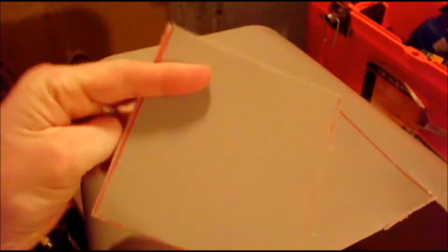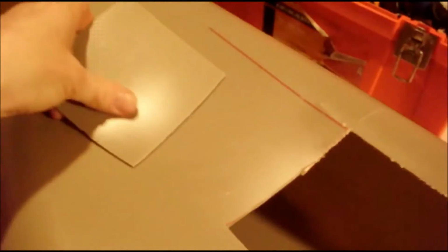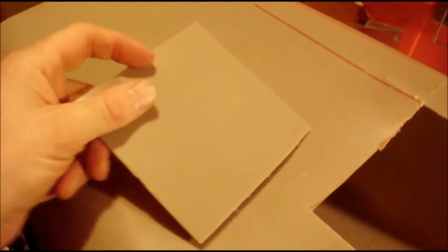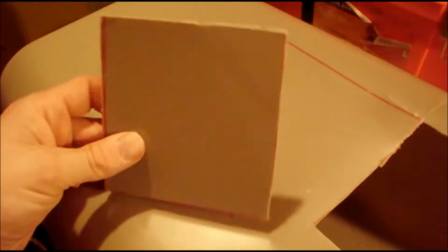All right, I bought one of these Rubbermaid trash cans at the Home Depot. And this is the plate that is going to go over there. You can see the lines. Thing is, I'm going to paint this, but I find that this material, and I've looked and looked and looked for craft materials and stuff, is the right amount of stiff. It's hard, but it's soft. You can sand it. You can paint it. Make sure you use plastic spray paint, like Krylon Fusion. You can cut it with a jigsaw and it doesn't chip up. It's not brittle like Lexan. I've tried to use that kind of stuff too. But anyway, yeah, this is what I've done.